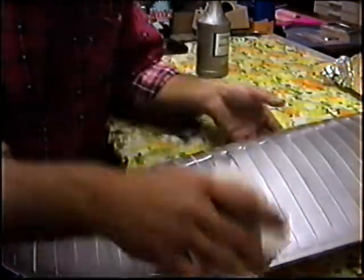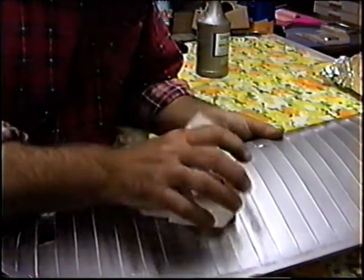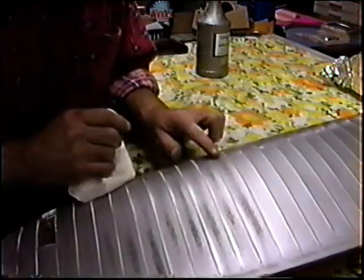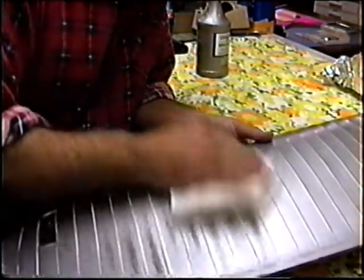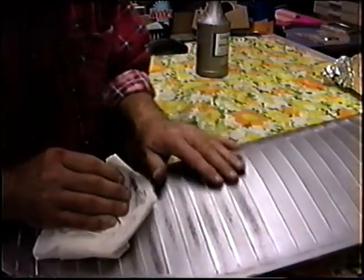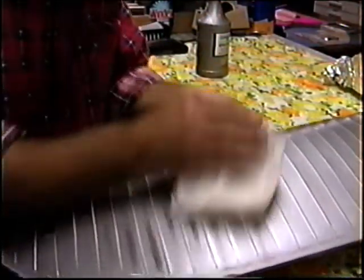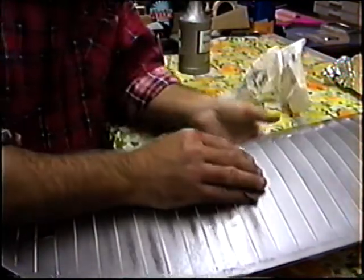Again, each coat gets sanded just a little bit easier. Leave a little more on until we have that film. We're just trying to get the mountaintops off without going through. I don't want to see any raw wood if possible. I have gone through in a couple of little spots where I've been a little heavy-handed. I try to examine each bay when I'm done with it. Again, it helps if you're not under any pressure to get this done.